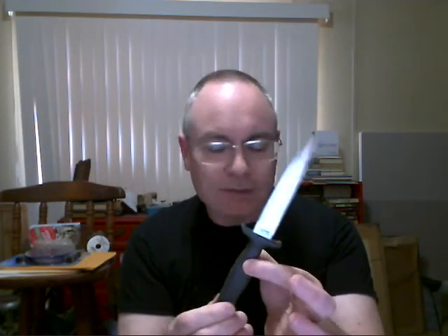A lot of knives like the Gerber Mark II, for example, have a very short piece of metal for the tang, and the handle is cast around it. In this case it's a cast metal handle — that's not the strongest method, depending on how long that tang is. Usually they're quite short; that's sort of a cheap way to do it, and if you put too much torque on it, that little piece is going to give up, especially if it's not attached very well to whatever the cast material is.